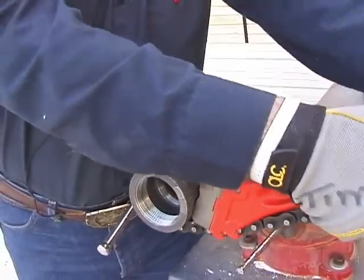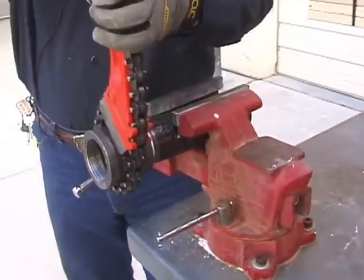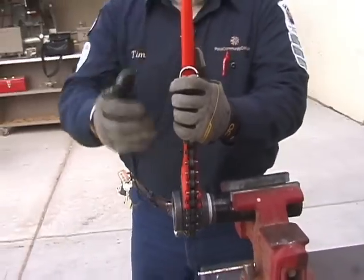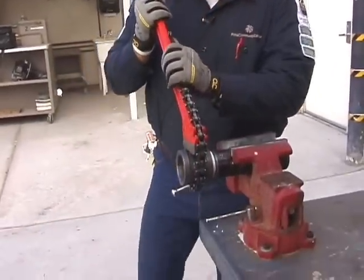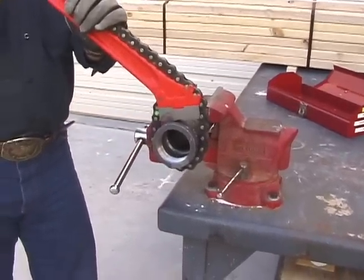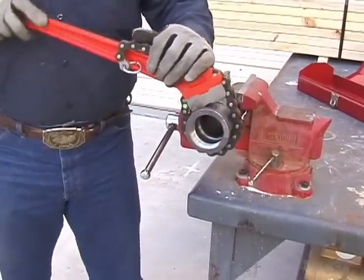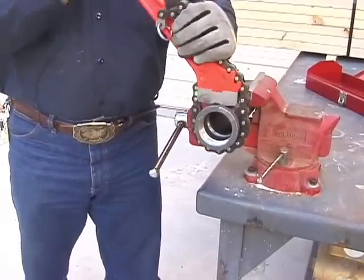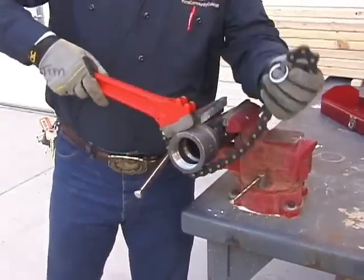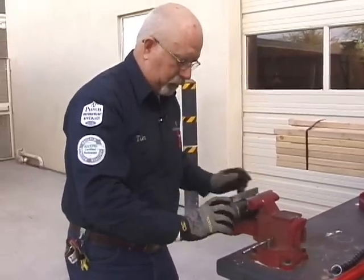For this exercise, we don't want you to tighten it like you'll never be able to take it off, but we do want you to get a feel for it — just firm it up. You will need to explain to the instructor or lab tech how you put this on. To remove it, back it off because the teeth go in the opposite direction and will grab in both directions. Note that cheaper versions, like Harbor Freight specials, may not have teeth going both directions. Loosen it up, set it down, and remove the coupling.